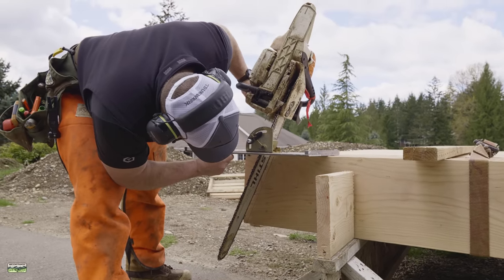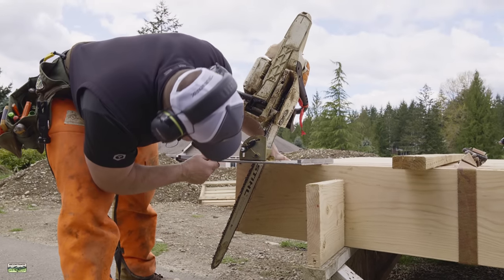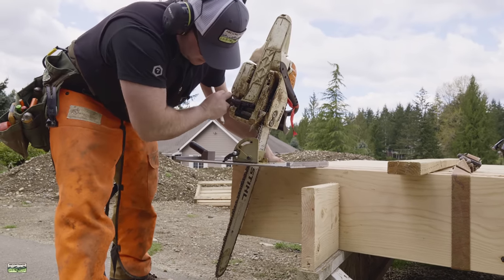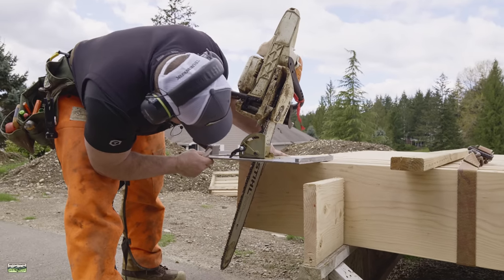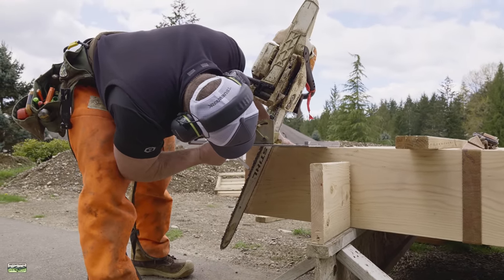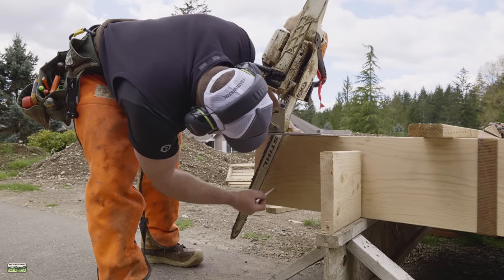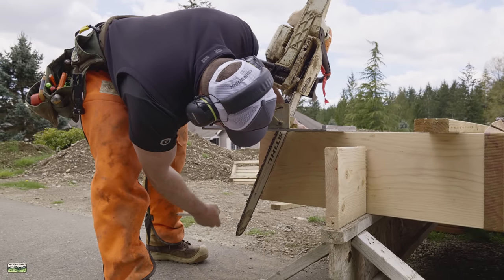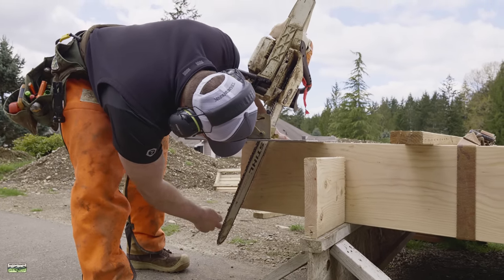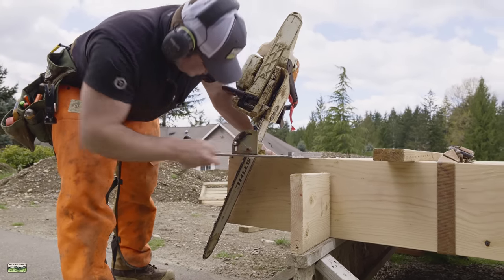I've got my 5/12 and I've adjusted the saw. You've got to make sure the table is parallel — you don't want any slop. I'll slide it right up to the line. I use my arm to support that side, and I'm going to put the tooth at the top. I'm basically using that to reference and register — I'm still parallel. I want the tooth cutting just right. A little bit of finesse. The tooth looks good — that tooth is close. This handle helps me hold it without the saw wanting to flop over.